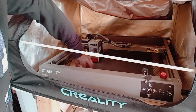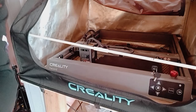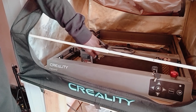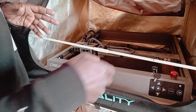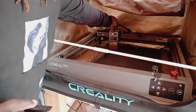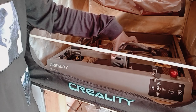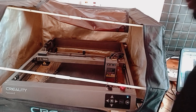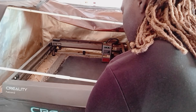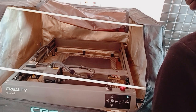I do a quick run — some places are higher, some lower. You particularly want to check that the laser head can easily travel, especially on the sides, otherwise it's going to pick up the leather and your work material will be spoiled. Since this is a clean material, we want to be really accurate. I give it another run and confirm the work area looks good.